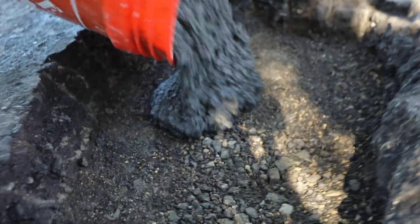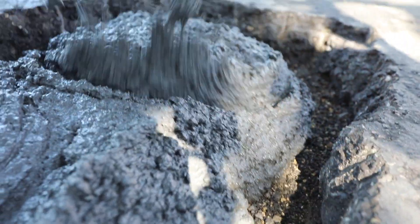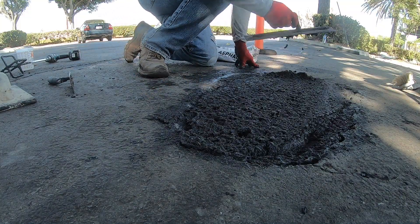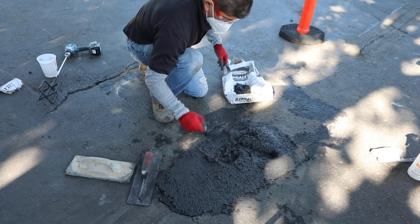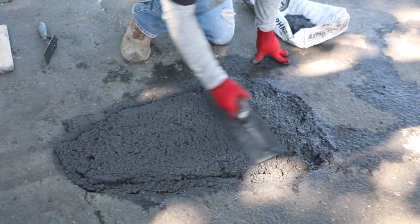Apply from 2 inches to 24 inches thick in full-depth sections. For thinner sections, use Rapid Set Asphalt Resurfacer. Place, consolidate, and screed quickly to allow for maximum finishing time. Since there is no tamping needed, do not install with a tamping tool like traditional asphalt cold patch products.